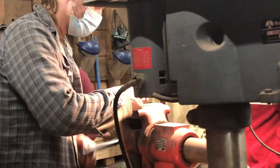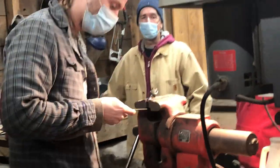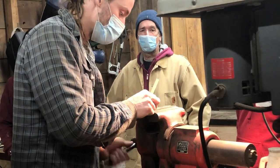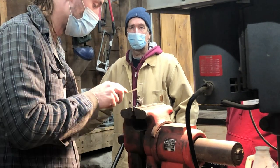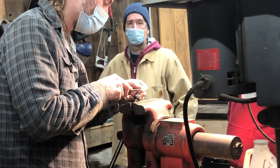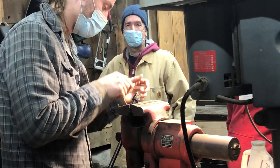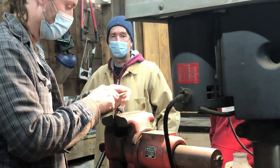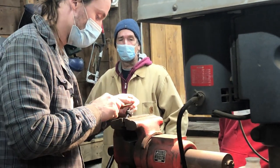And when I'm sharpening these, I've sharpened the edges. Most of the time I'll just clamp them in a bench vise as I'm working. But with a small flat file, I like to clamp them on an angle, so that my filing is pretty close to horizontal. That way my hands can rest on here and my elbows can lock against my side. I'm not trying to keep this exactly something, the body motion is just a lot more natural.